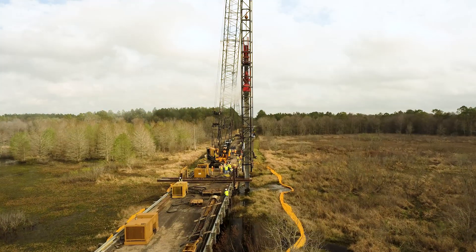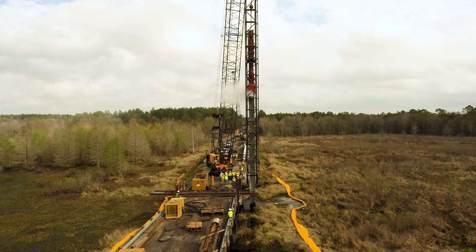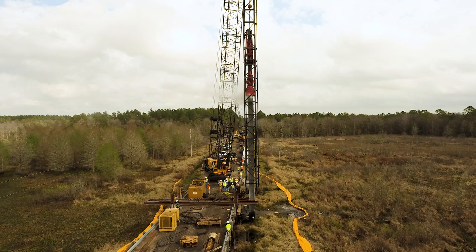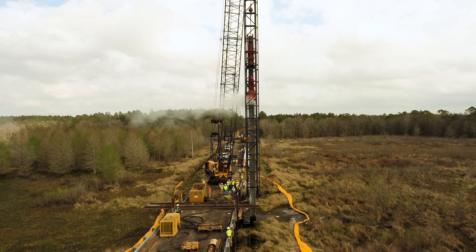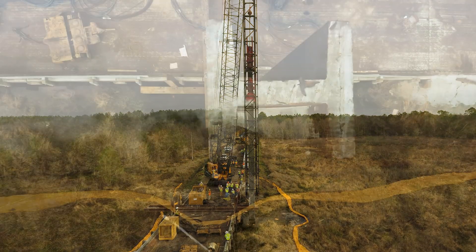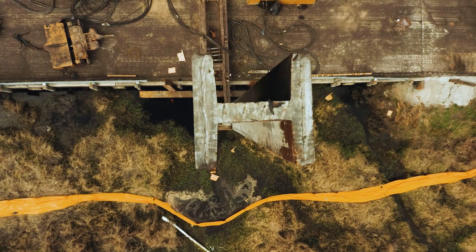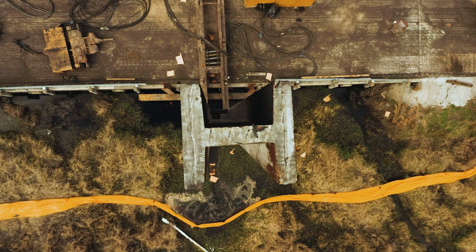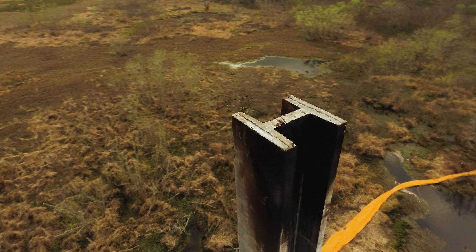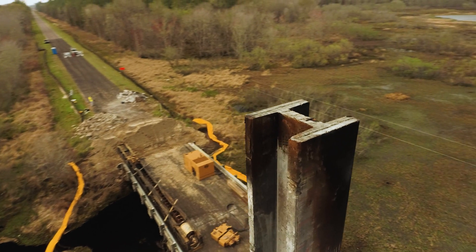The similarities to our prior tests with the square piling didn't stop with the real-time data reporting or the ease of installation, as the pad between the hammerhead of the D62 piling hammer and the top of the piling again caught fire and began to disintegrate from the friction between the two materials, as can be seen here. Aside from the soot and residue left by the burning hammer pad, there was no damage whatsoever to the top of the piling, proving once again that CoreTough UHPC is the only name you need to know for all of your UHPC needs.